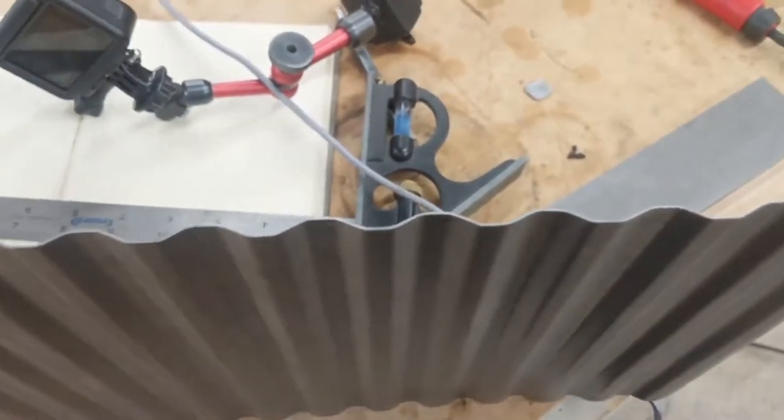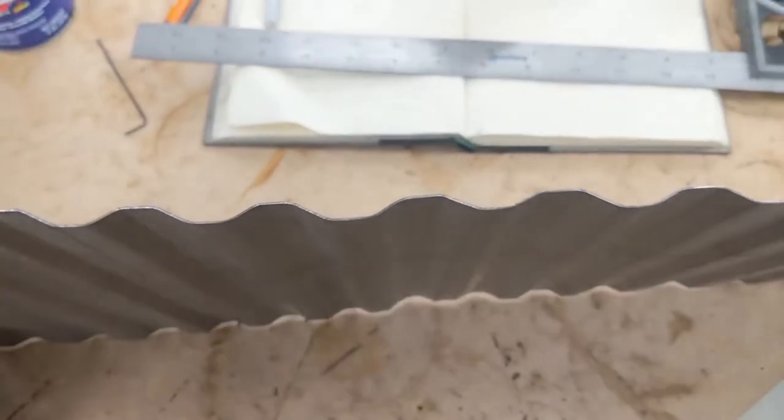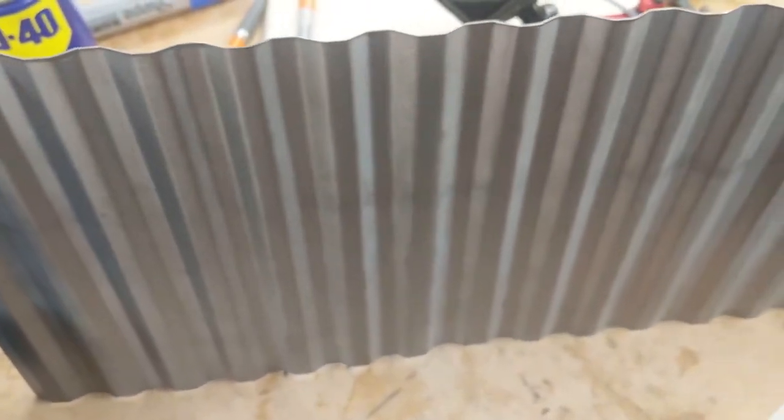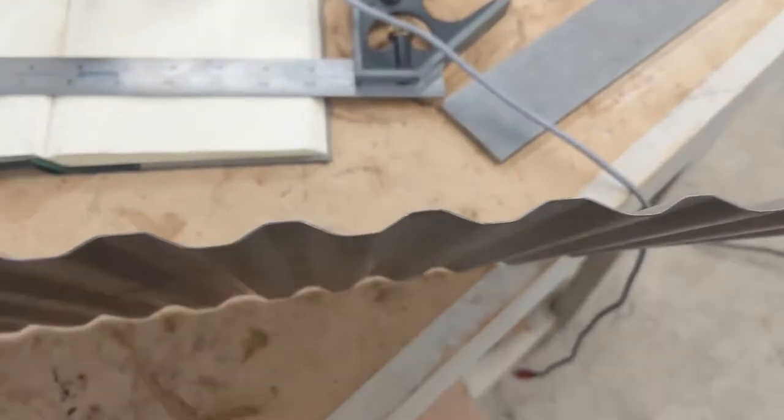Since I wasn't going to replace the entire apron, I accepted this as a basic constraint. I tried bending a sheet using the width of the apron as the crest and trough width. This made the corrugation slightly out of scale, but not unacceptably so. The results were a lot better, and it went by much faster as I wasn't using the scribed lines at all, just lining up the previous bend by feel.